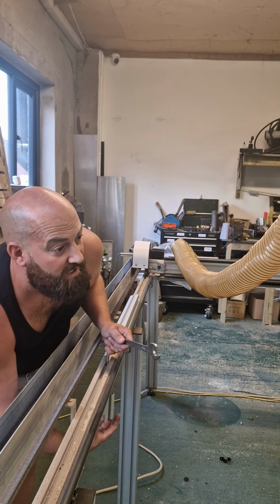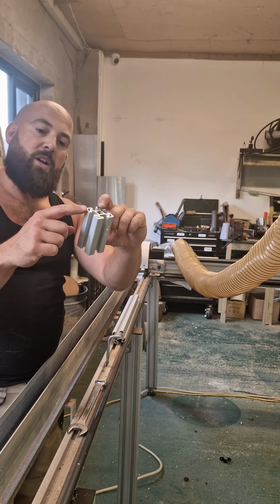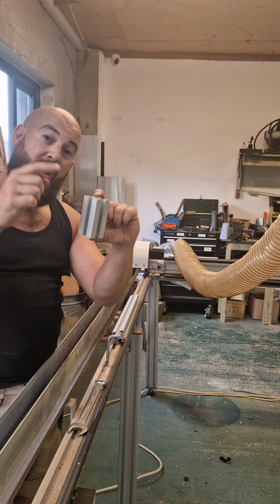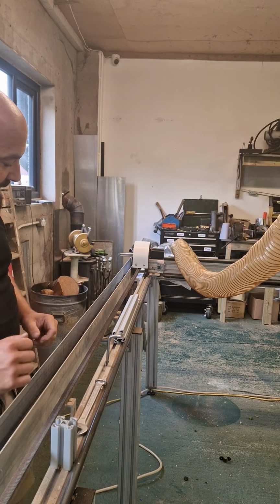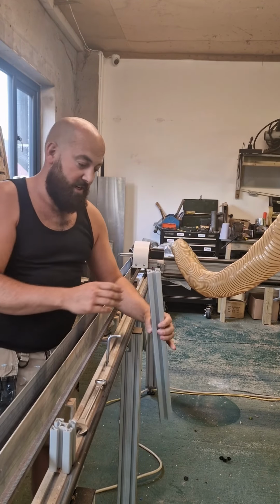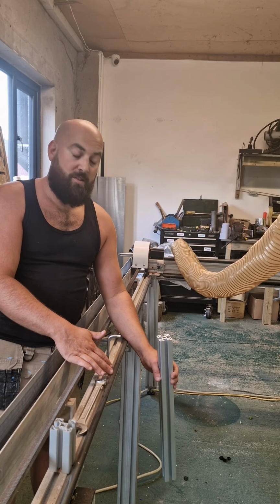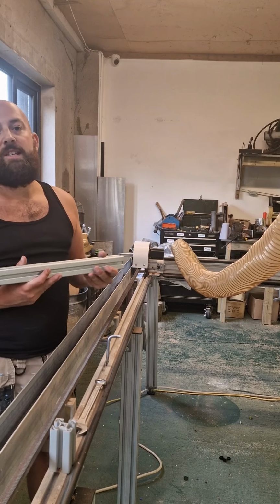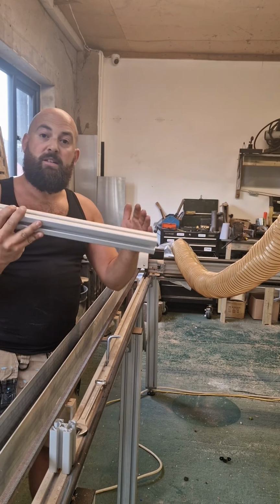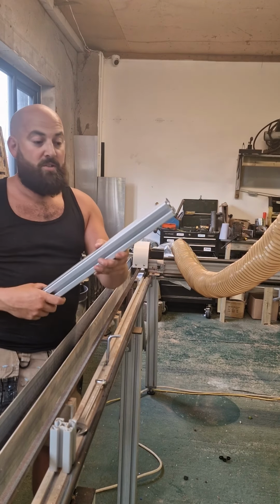So my CNC originally only ever cut to the depth of 80mm, which, believe it or not, is that. So that was the depth from the top of my collet to the bottom of my cutter. That's as far as I could go down on material from the bed up, if that makes sense. I'll demonstrate later on. So I've got my new one, which is 500mm. The difference now is I'll be able to put literally half a tree in here, and I'll just pack it up, lift it up, whatever, each time I do a pass, and I can reduce it to the size I want. Not that I'm ever going to take 500mm off, but I can literally clamp a chopping board in here now, 500 wide depth, clamp it to the base, and I'll be able to sort of router out logos and do some lovely writing in some boards. So that is my theory in this.